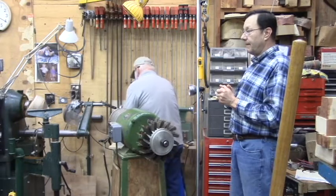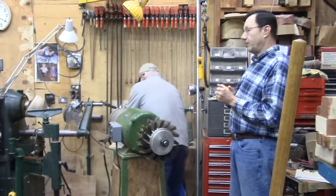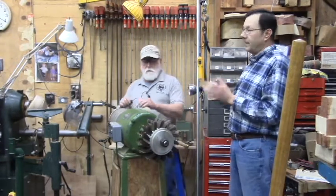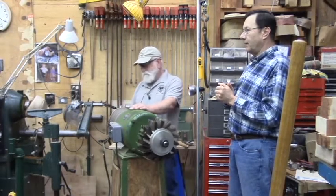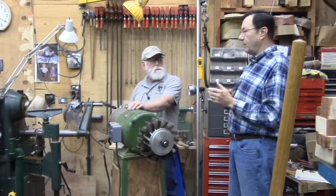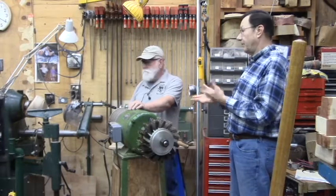And you're talking also 110. No. You can't put a variable frequency drive on 110. That's the sad part of it. Unless, I think there are some DC motors that you can do that with. That's the only thing I'm aware of. That and universal motors can be done with variable speed. But generally speaking, the only ones that can run on variable frequency drives are three-phase.